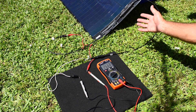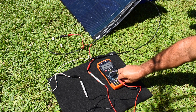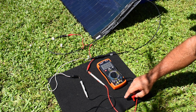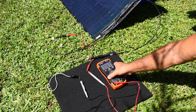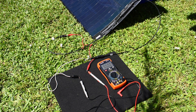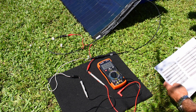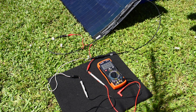When the panel sits in the sun, just like any other solar cell, the output voltage drops as it heats up. So let's look at the short-circuit current. If you don't have this inexpensive tester, I'll put a link in the video description area — it works very well. The reading is 9.87, 9.86 amps, which is actually above what the manual states. According to the manual, short-circuit current is 9.48 amps. So we came in a little bit lower than spec due to heating, but everything tests fine for the panel.